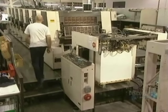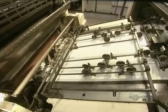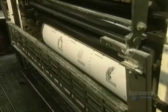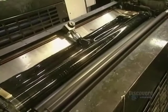This is a six-color offset process printing press with a 72 by 108 centimeter capacity. The press is fed by a suction and friction process, devouring 8,000 sheets an hour. The printing plate is placed onto the press cylinder, and this plate will contact the inking rollers of the ink reservoir. To prevent it from drying, ink viscosity is maintained with an oscillator.